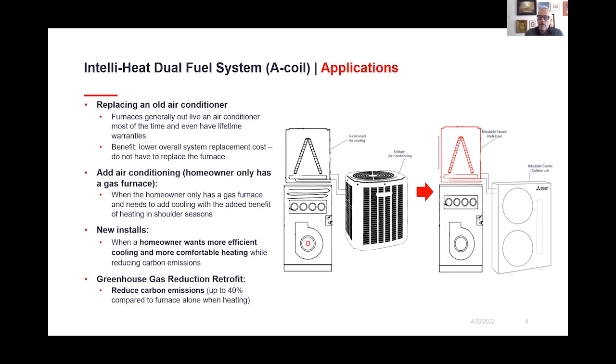The old heat pumps that probably a lot of our parents or some of us may have been used to, those discharge temperatures were not very hot. If you have a discharge temperature that's 96 degrees, that's still below our body temperature, so it's not going to feel warm. So we can see heat pump temperatures of 135 degrees discharge, which is very warm. And again, as Brett said earlier, he did survive a winter very comfortably, and we're happy about that. We have lots of projects throughout the Northeast and the Central North that have been very effective using our heat pumps.